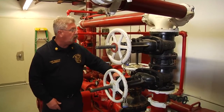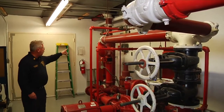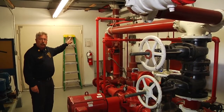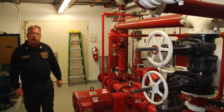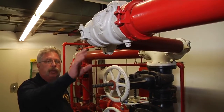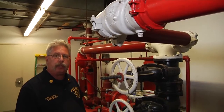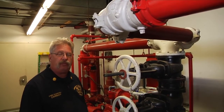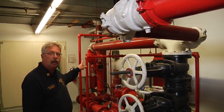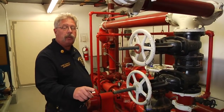Back to the bypass loop — with the bypass loop in place, when the fire pump is out of service, water can move around the fire pump in the bypass loop and supply the building's sprinkler and standpipe system at street pressure. The fire department would be able to pump up the fire department connection. In this case we see this four-inch pipe — this four-inch pipe is piped into the bypass loop. Any fire department connection piping on a building provided with a building fire pump has to be piped into the discharge side of the building fire pump.